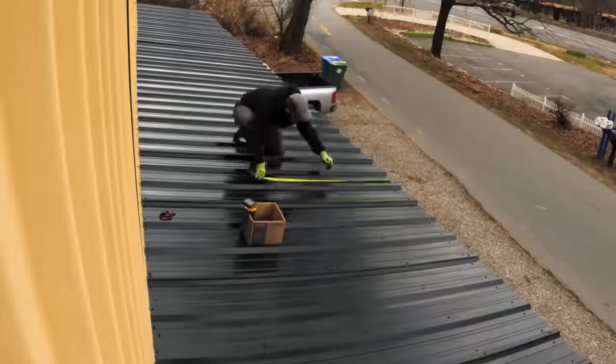The last thing I need to deal with to wrap up the porch is to add some kind of trim to cover up the rim joists and also caulk around the edge of the gable trim. I'm going to be adding a pressure-treated 2x12 for the trim here, which should match the rest of the porch framing nicely. That said, I want to wait until my new garage doors are installed before adding this trim, as the 2x12 might be in the way otherwise. So with that, I could officially call the porch project a wrap.